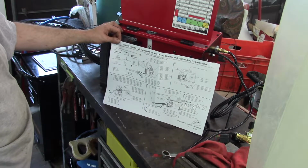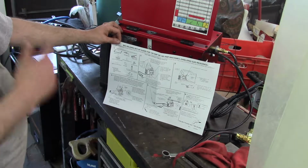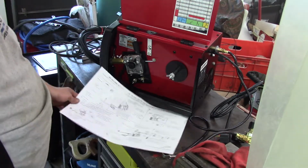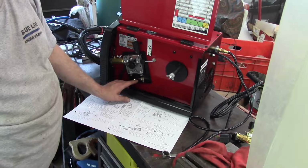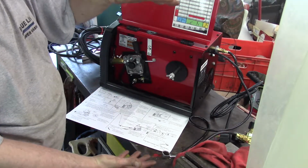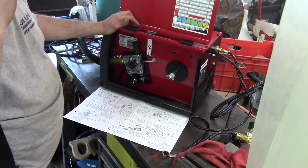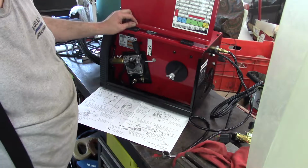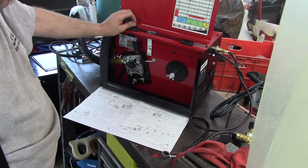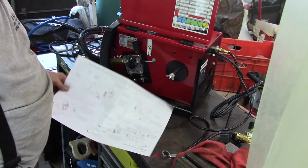I'm renting 4 bottles right now, and it's killing me. And I'll show the bigger bottle in a minute that I'm going to be using, which I don't really need for this. I could probably run this off a Beermeister size bottle, a little bit bigger than a fire extinguisher, and it would probably run forever. If you're not welding in the middle of a hurricane, MIG welders don't really use a whole ton of gas. The TIG welder, on the other hand, gobbles up gas like it's free, and it's not free. It's $100 to fill the big T-tank, which I'll show in a minute.